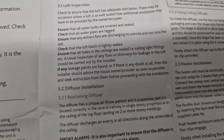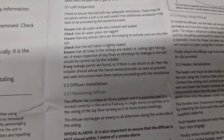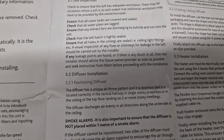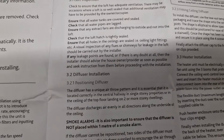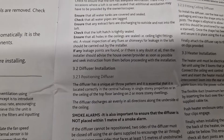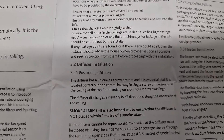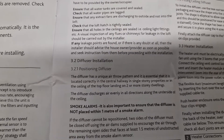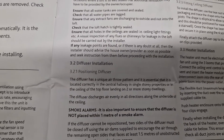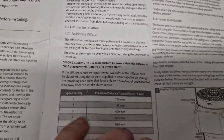It tells you in the loft space to check that your water tanks are covered and sealed, pipes are lagged, all extract fans are going to outside and not just blowing into the loft, the loft hatch is sealed, any holes coming through from light fittings or spotlights and pendants are all sealed. Any flues or chimneys aren't leaking into the loft space either. If there's any doubt, you need to advise the homeowner and make sure remedial action is taken before you proceed.